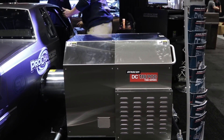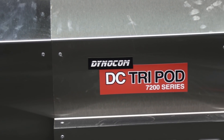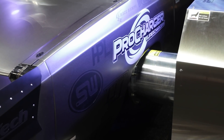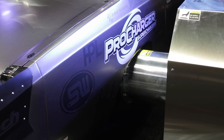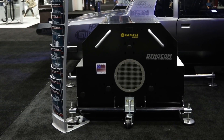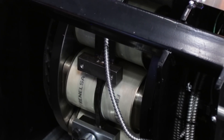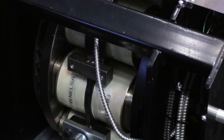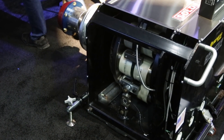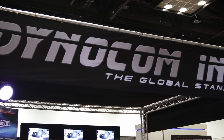The crown jewel of this year's display is obviously the tripods. So the tripods, just like the others, have a stainless steel multi-disc coupler input for safety. They have anti-vibration technology — the most powerful hub dyno you can buy in the world. What separates them is our specially designed in-house planetary gearbox that can feed three eddy brakes, two eddy brakes, or an AC motor. They're very modular; we can build them any way you need for whatever power or synchronization you need between the pods.